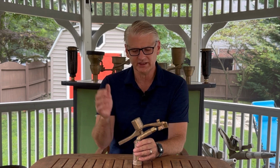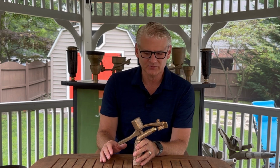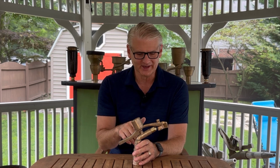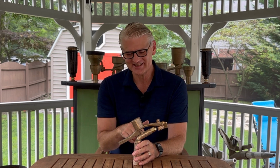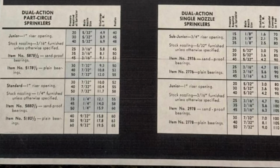And then eventually I'm going to do a whole video on the dual drive lines and see if I can get some help from another collector to round out what I have to show for it. But anyhow, like I said, for the fourth time now probably, this is a single nozzle full circle. And so I started looking at the only literature I have from the time, and saw that the single nozzle full circle versions of the dual drives started with a 2.9. And I'm going to say 2.9 instead of 2.7 because that was another option. But the 2.7 had a plain bearing. This has a sand bearing on it. So I'm fairly certain this was a 2.9.